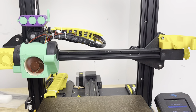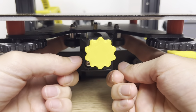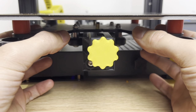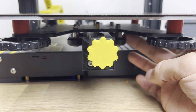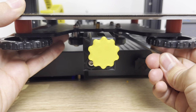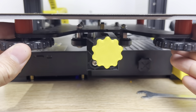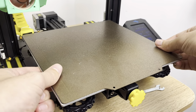Next up is one of the lesser known mechanical adjustment points of 3D printing: the roller wheels that hold your Y axis stable. One way you can tell if these are loose is to grab the base plate under your bed — not your bed but the base plate — and wiggle it back and forth to see if you have movement. If you do, you can tighten up the eccentric nuts on the right side. But today we're going to be doing the opposite and loosening these, and this is what it looks like when they're loose — quite a lot of slop in all three directions: X, Y, and Z.